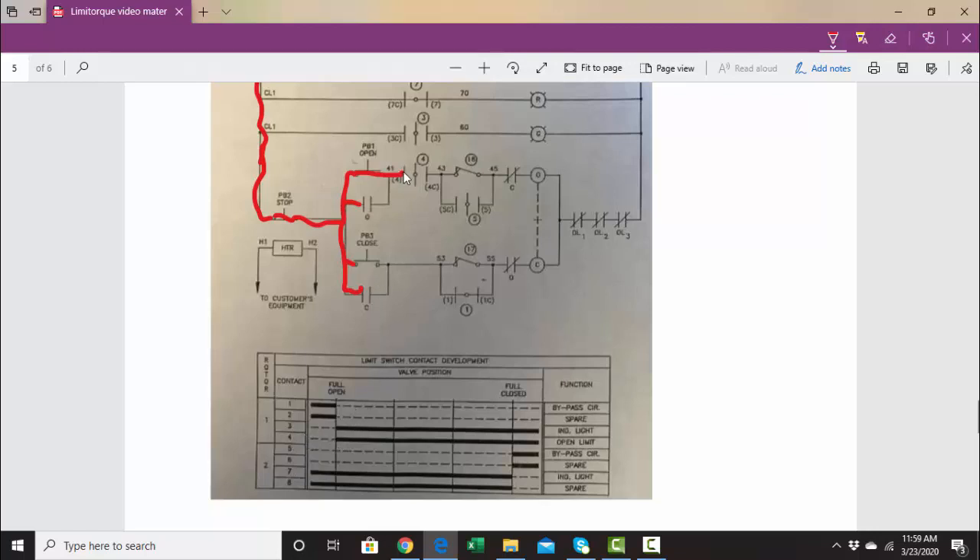It's not going to open until we get fully open, so this is going to be made up all the way to this point here. Now we have a torque switch — when there's too much torque going in the open position, this will open up. But in parallel with that torque switch we have another limit switch, that's limit switch number five. Limit switch number five is always going to be open until we get to the fully closed position. So since we're not fully closed, this is going to be open. As long as there's not too much torque on the shaft or on the valve stem, this torque switch is going to be closed, so that will let the power go through.